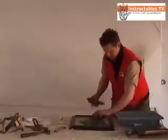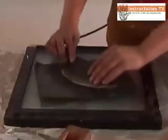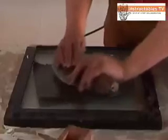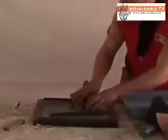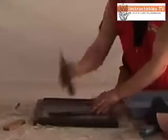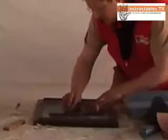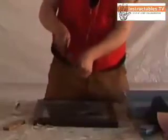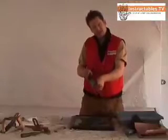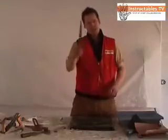Here's my 400. And then you go up to your finest grit — I'll stop at 600 because I'm lazy. It's just a couple of strokes. You raise it ever so slightly and you see that you're shaving off and pushing this metal mud along with the grit. And that's how you do it — on both sides. Then you can catch your thumbnail there. Now that's a sharp and strong edge. That's good for cutting wood; that'll last a long time. That's how you sharpen a knife for cutting wood.